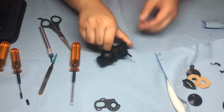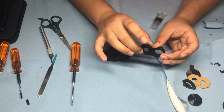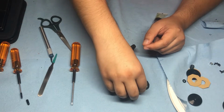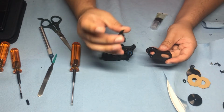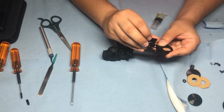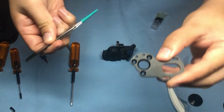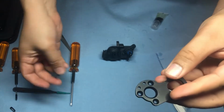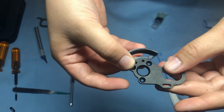So now we're going to install the motor plate and the Spur Gear guard. So we have to take note of the orientation, that the Spur Gear guard goes on the opposite side of the countersunk holes. So make sure y'all can see that. These are countersunk holes here. On the back side it's flat. So this cover will go on the opposite side of the countersunk holes.